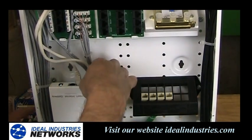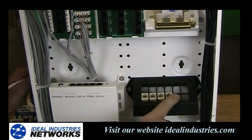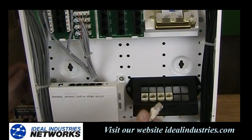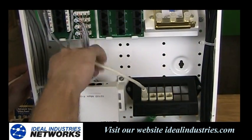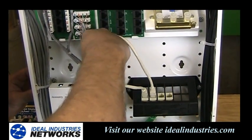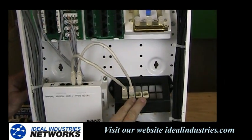If our solution is a Cat 6 solution — meaning you've got Cat 6 cable pulled, not 5e — this is how we do the Cat 6 solution. These are Cat 6 jacks put on the end of a piece of Category 6 wire. If we need data at an outlet for a computer using Cat 6, we grab a Cat 6 patch cord, plug it into that Cat 6 jack, and then plug it right into our router or switch, which jumps data to that particular outlet in that room.